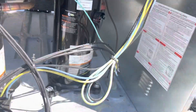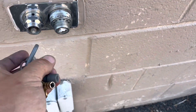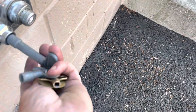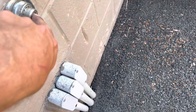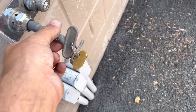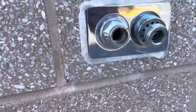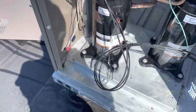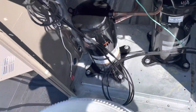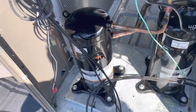I'm going to try to get a hose up here and spray them with water. My only water supply in the building is turned off and does not work. Maybe I can get a bag of ice somewhere and put it on top of the compressors. Found another hose, but the stem is completely missing out of this one. I've got to do what I've got to do — I've filled up a bucket from inside and I'm just pouring the water right on the compressor. I'm going to do both of them; hopefully I can get them out of thermal overload.